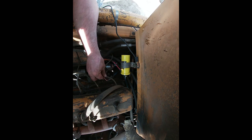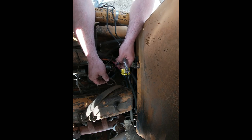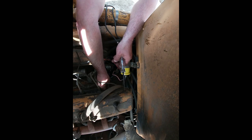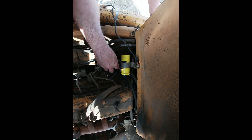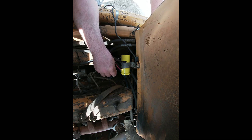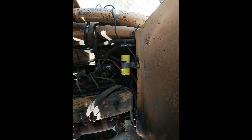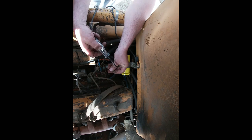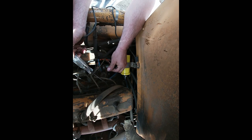We'll turn on the key and we're going to test both of these for 12 volts with our handy-dandy test light. The one that has 12 volts is going to go to the positive, the one that does not is going to go to the negative. I'll go ahead and put this, what I believe to be temp sensor wire, in its place. Turn the key on — one of my favorite things about this skid steer is the god-awful squealing noise it makes when you turn on the key. Amazingly, that battery held juice even after a year of sitting and making it through winter. We've got 12 volts there, no 12 volts there.